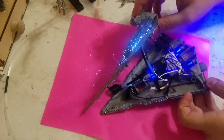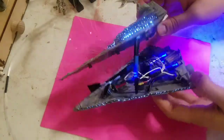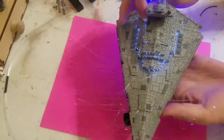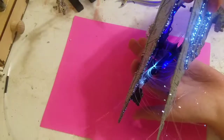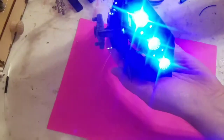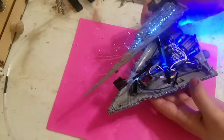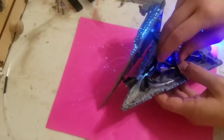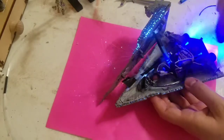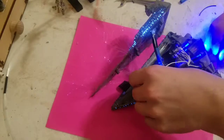When you're done with all the wiring, you should make sure you do a few test runs to make sure everything's working. Try closing the model and putting everything in place to make sure that nothing ends up getting shorted, or that you have any cold welds that may come apart when pressure is applied. If you're all set and happy with everything, we're good to put the final touches on the ship, which include locking the switch and recharge port in place with green stuff.